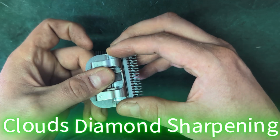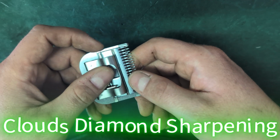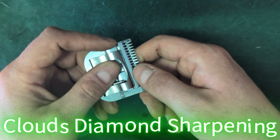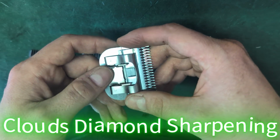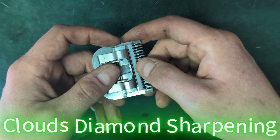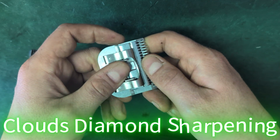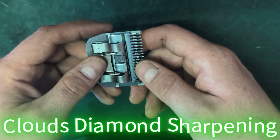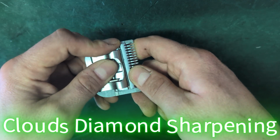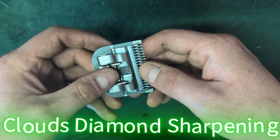So if I had 5 pounds of pressure, 3, 4 pounds, 3 is not bad, but we try to generally be under that. But if it's 3 pounds of pressure, it probably won't damage your clipper, but the blade will get really hot. If you're at 4 or 5 pounds, it's probably going to damage your clipper, almost 100% guarantee, because the clipper doesn't know to not move. It just keeps moving. So we want to have it with the least resistance, so the clipper breathes easier, it doesn't get as hot, it doesn't burn your brushes.